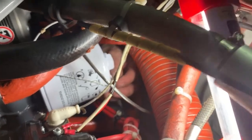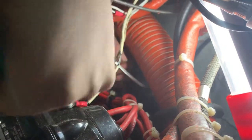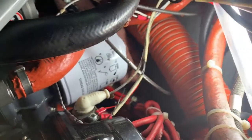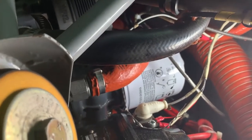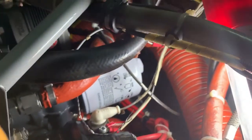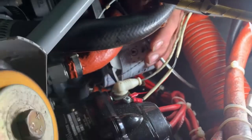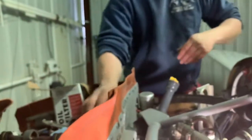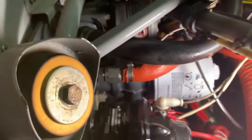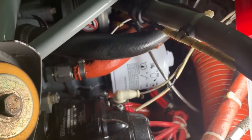As you guys can see — when you cut it too short, it unwinds. You can actually grab it and pull it off. That's what happens when you cut it too short — a prime example of what not to do. This is a teaching moment. It happens to the best of us. Always good to have a pair of long dykes because it makes getting the safety wire off easily. So we get a piece of safety wire long enough and try it again.